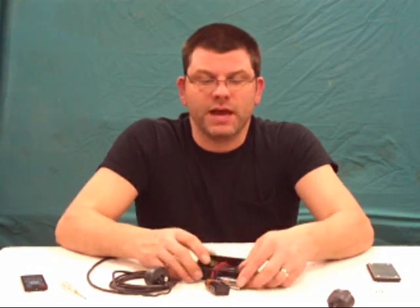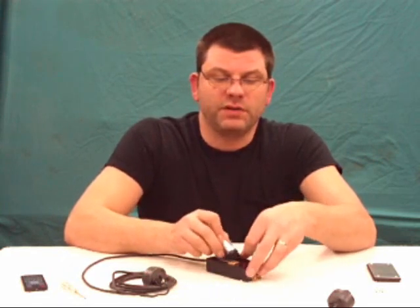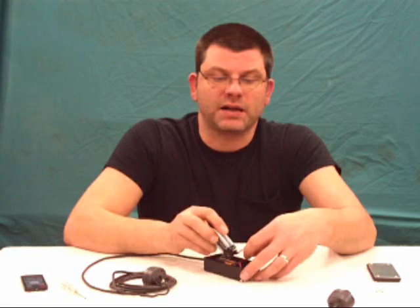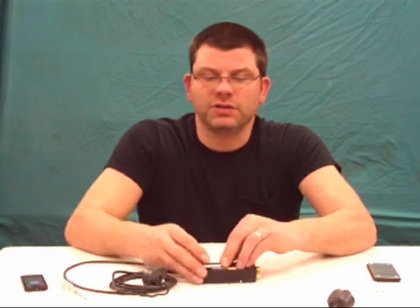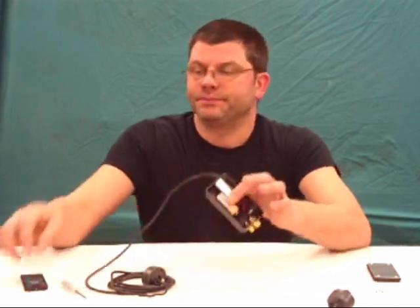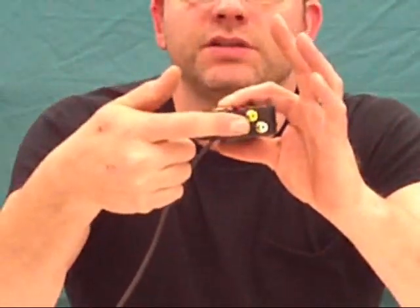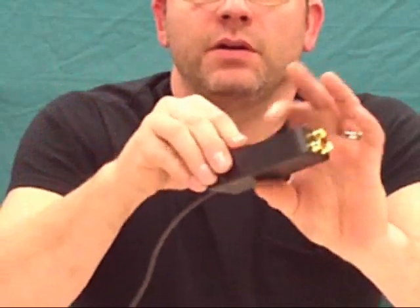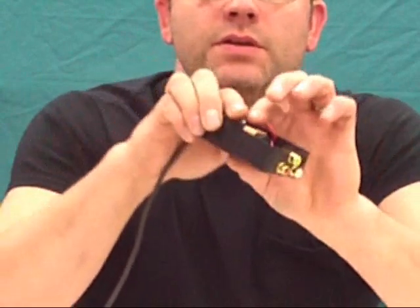So yeah, after you get all that assembled, the 9-volt batteries fit in here pretty snug. Not snug in the box, but once you put the cover on. So they just lay in here loose. I slid them all the way to the back, to the opposite end from where the USB cable goes in versus where the RCA plugs are. That way they're far enough away from all your soldering points on the interior. Once you get that done, you can reinstall the cover.